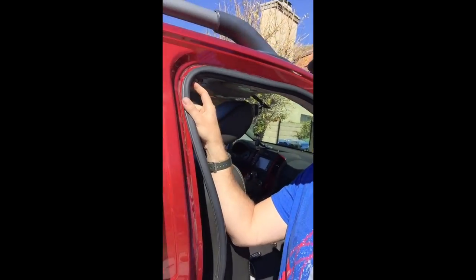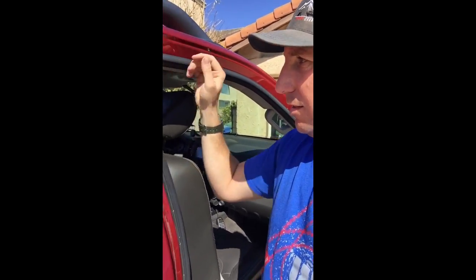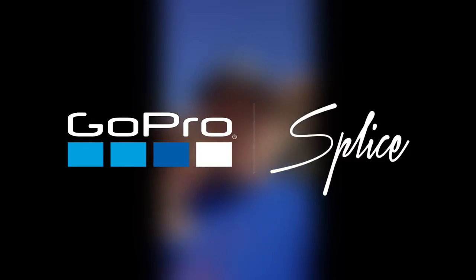Also, sometimes you'll put this on and it doesn't fit. So make sure to put this corner up in first, get that corner up in first, and then you can kind of pull up a little bit. Make sure this corner's up in first and that'll help line everything up. You can work your way down and make sure there's enough room for that to move in. That's your little tip of the day — something I've learned after doing many, many molding jobs. Thanks guys, next time.